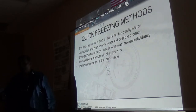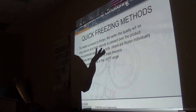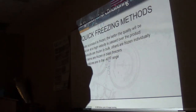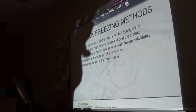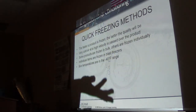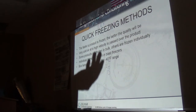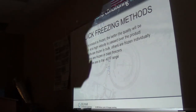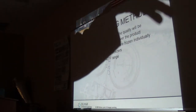But your whole freezer is negative 10, right? Not necessarily. The general range is zero, for a residential freezer. Do yourself this favor: get the temperature pressure chart. If your home freezer is at negative 10, that means your refrigerant in there will be boiling at negative 20. Check the R134a pressure that corresponds to negative 20 degrees. You're going to see it's practically in a vacuum.